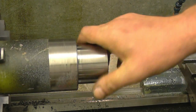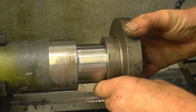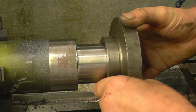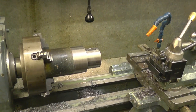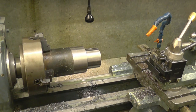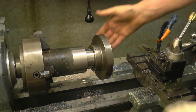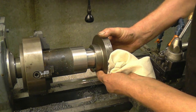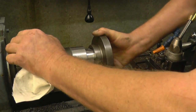It's probably three tenths over two and a quarter now. It is very, very slightly warm to the touch. What I'll do — I'll put the kettle on, let that cool off and we'll try it again. Right, now it's cooled down to room temperature — that's what we're looking for. All I did was let it cool from lukewarm to room temperature and you saw the difference in the fit. That's an excellent fit — just gripping nice.